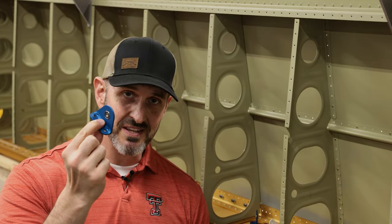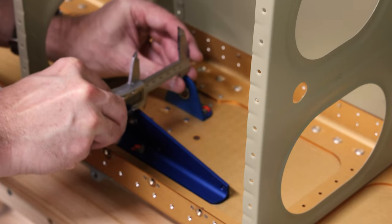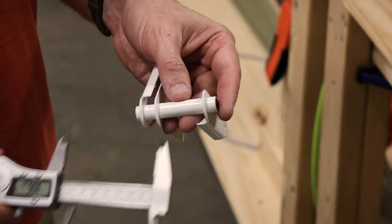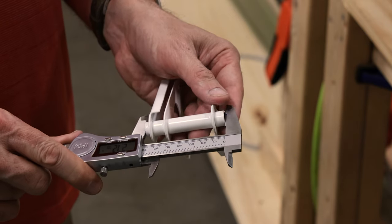The steps are pretty straightforward. The first thing you do is bolt these things to the main spar on the wings. I did that not knowing I'd have to take them off, but you do, so I marked them up with some orange goop. Then with your calipers you measure the distance between the hinges, and after that you measure the length of the pivot tube on the bell crank.